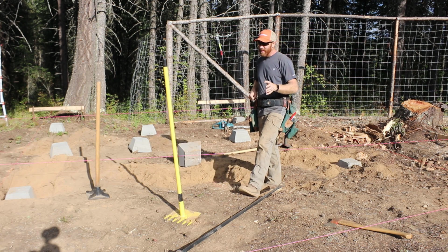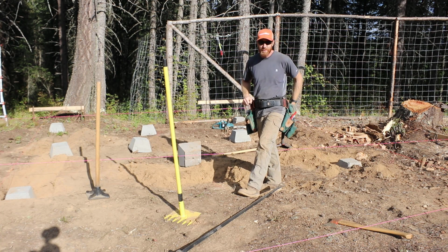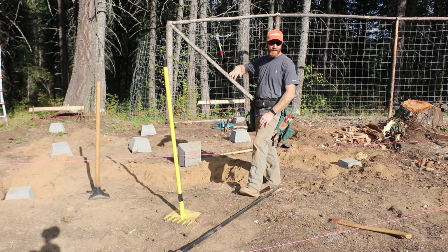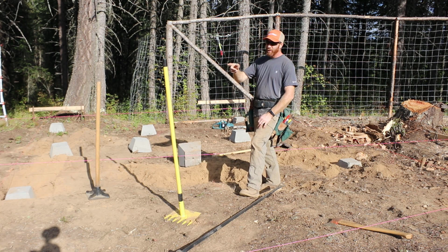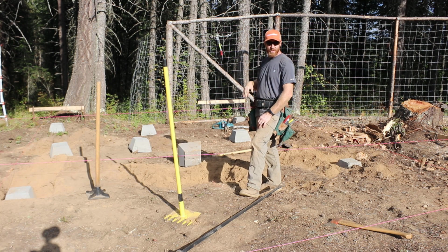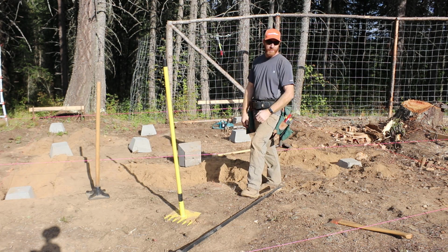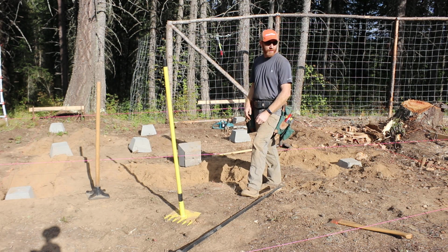So that being said, we're using a rotary laser, a Hilti PR26 I believe it is, with a receiver, and I've gone through and verified that I'm either at that elevation or lower. Now when I cut my blocks, I want to cut each block so that when I set the laser on top of that block at each location, it's a solid tone. I know it's level, it's in the correct plane, and then we can set our floor joist system on top of those blocks, and I know my floor is more or less level.